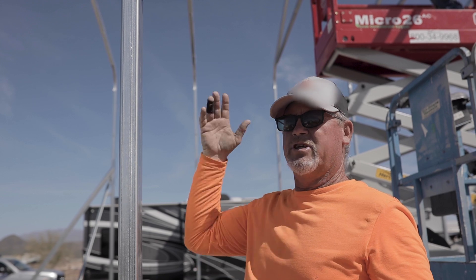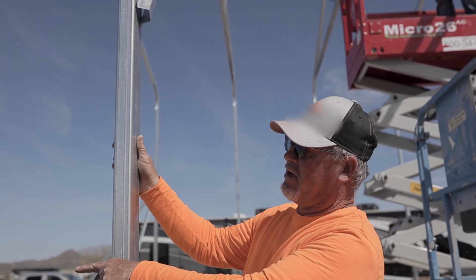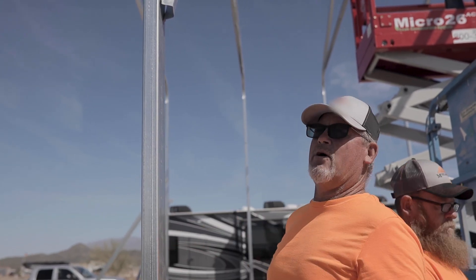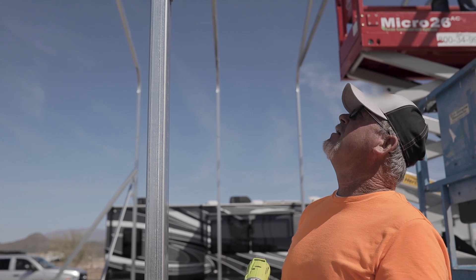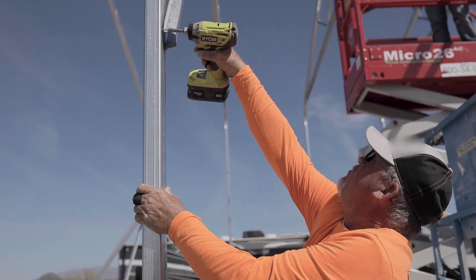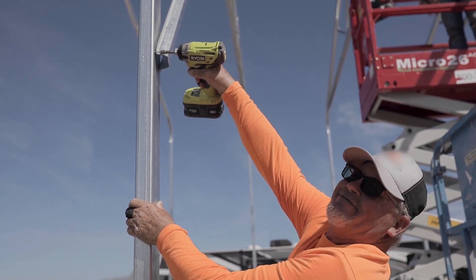These won't come off until we're completely screwed off all the sheeting and then it's rigid — we pop them off. That's why we'll do every truss except for the gables, because the other ones hold that one where it needs to be. These will just move this way and that way so we can get them along the line, and once you do that they should be pretty much straight.